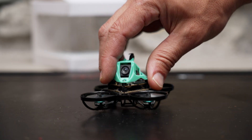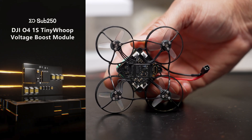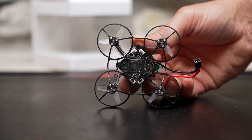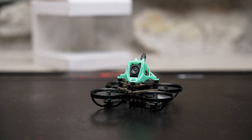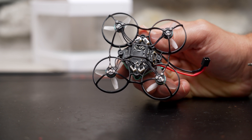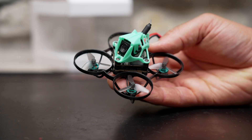The all-in-one board is the Red Fox A1. It does now have that BEC to power the DJI O4 reliably all the way down to the end of your flight. It has a built-in ELRS receiver, which is an SPI receiver, not a UART-based receiver. To bind mine, I just put in my binding phrase with a CLI command using a handy tool that's available on the ELRS website — I'll put a link to that page in the video notes because it does make binding quick and painless. The all-in-one board does have a micro USB port; USB-C would be better, but at least we have a proper USB port so we don't have to fiddle around with dongles.